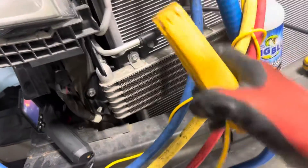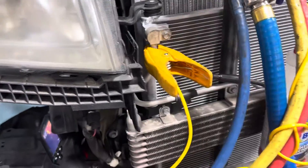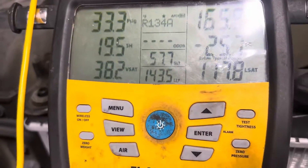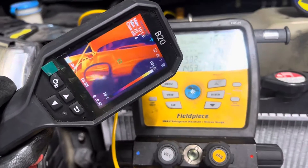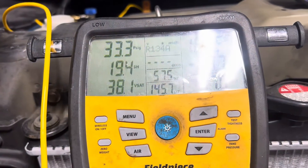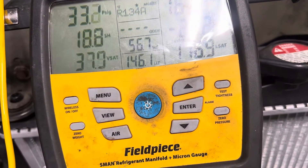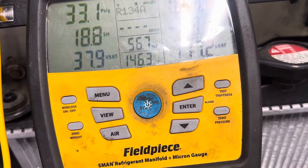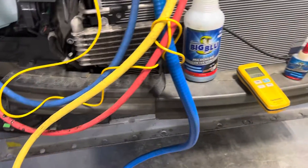See my clamp right here? Let's get the clamp off the liquid line. So we're at 106 on the liquid line. Now we're on the vapor line going in. Let's see what that temperature comes up to. Did it hit 149? I think this thing said 149 on this. That was 106 at the outlet, and now 146 on the vapor line going in. So we got a 40 degree difference in temperature drop over that condenser.